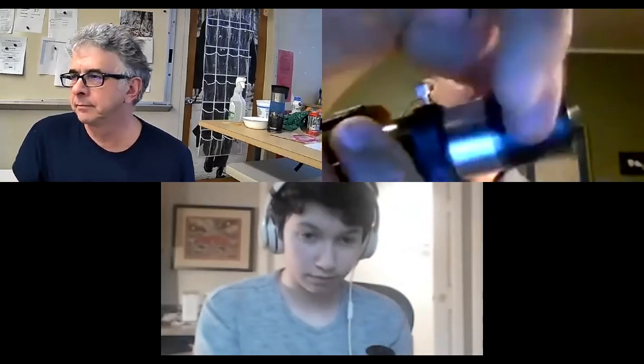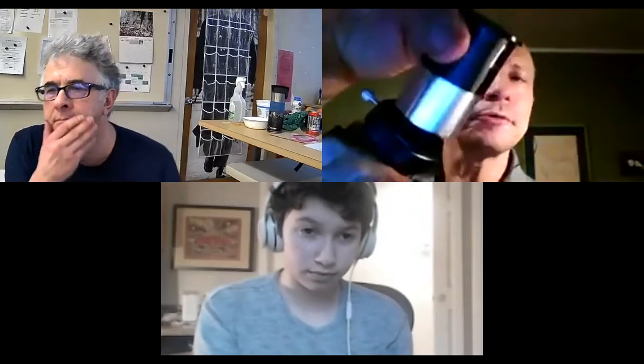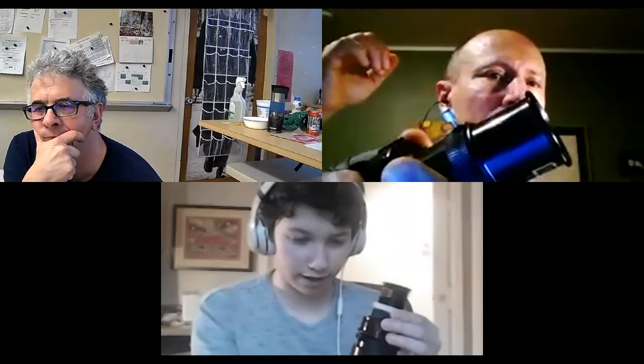On the Barlow? Yeah, it should be there, but you shouldn't have it in all the way. So back that screw out a little bit so that your eyepiece can go in. If your screw's down all the way, your eyepiece won't go in. The eyepiece connects to the Barlow, and then the screw gets in the way of the Barlow part going all the way.